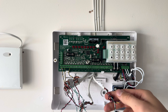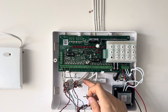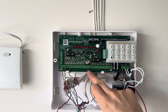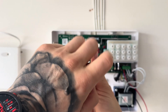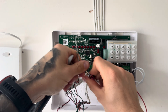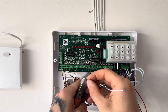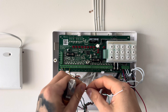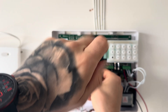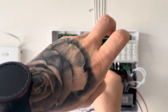On this we've got a bed PA, a bed panic alarm. Because we've got a separate zone for this, we don't put a panic alarm into zones 1 to 8 — those are reserved for door contacts, passive infrared, shock sensors, and all other things. We have our own specific zone for a panic alarm. So take out the link in the PA section and wrap around the cables you don't need. In a PA you don't need power, so you'd only have your zone and your tamper — in our case blue and yellow and green and white. Pop blue and yellow into PA and tighten that up. If you had more than one panic alarm, you would wire these in a daisy chain.